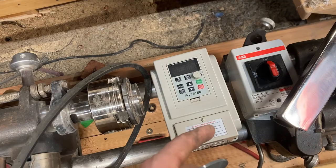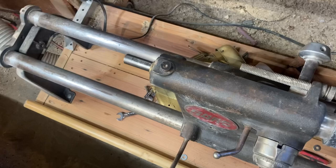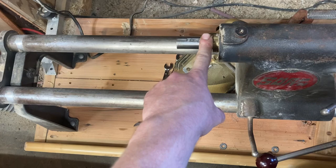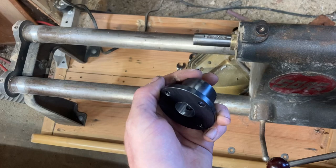I just pulled off the pulley and picked up all the new pulleys I was going to use. Fun fact: Shopsmith in their infinite wisdom decided to make this a 13/16" shaft, which is a non-nominal diameter for most pulley sheaves. So I got a three-quarter inch pulley sheave and bored the hole out to the correct diameter on the metal lathe so it fits on nice and snug.